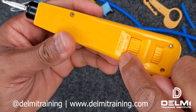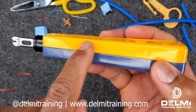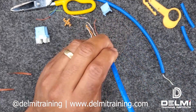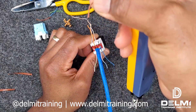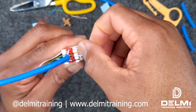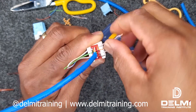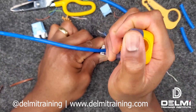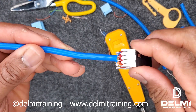When using your punch down tool, you can change the settings depending on how much impact you want to be delivered on the side of the blade. Also bear in mind that the yellow side tells you where the cutting blade is, so always make sure that side faces away from the jack. Now holding my jack securely, I punch down and you notice that it cuts it off smoothly. Once you start double punching or it's not cutting and you have to twist after every cut, you need to change your blade — and by not doing so, you can also damage the cable where it makes contact with the metal connector in the jack. As you can see, I got a smooth cut on each and every end of it.